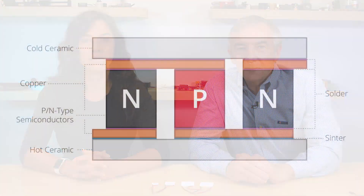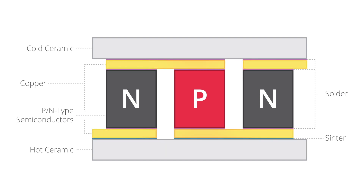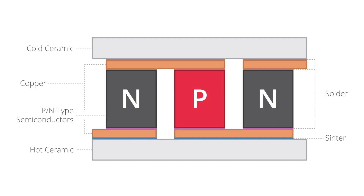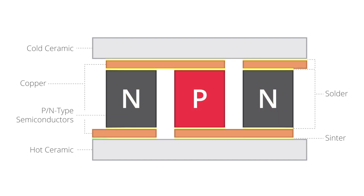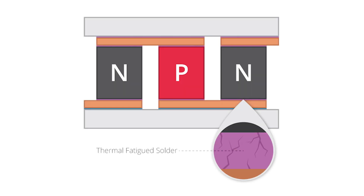However, they do have limitations. Within a conventional structure, solder is used to bond the electrical interconnect, which is copper, to the PN semiconductor elements. Soldering is also used to form the bond between the electrical interconnect and the ceramic substrate. This process initially creates a strong mechanical, thermal, and electrical bond, but the integrity of this bond can begin to degrade and thermally fatigue when the module sees repeated heating and cooling, as is normal when Peltier modules operate.